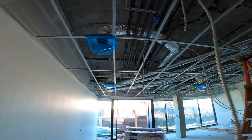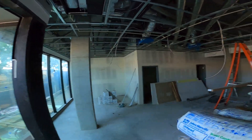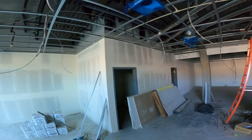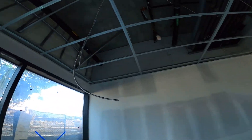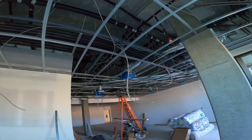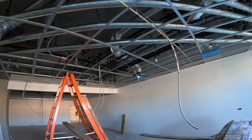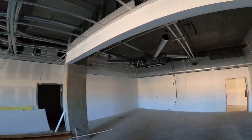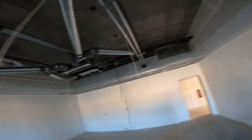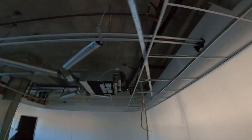So this is the cafe — future tenant space. It's really weird because there's nothing in the walls and nothing supplied over here to power the future tenant. The panel's inside the electric room. We have a couple conduits coming over in the slab up here for lighting — it's only two circuits: lighting circuit one and circuit two. That's it. Two 20-amp circuits for lighting, all LED.